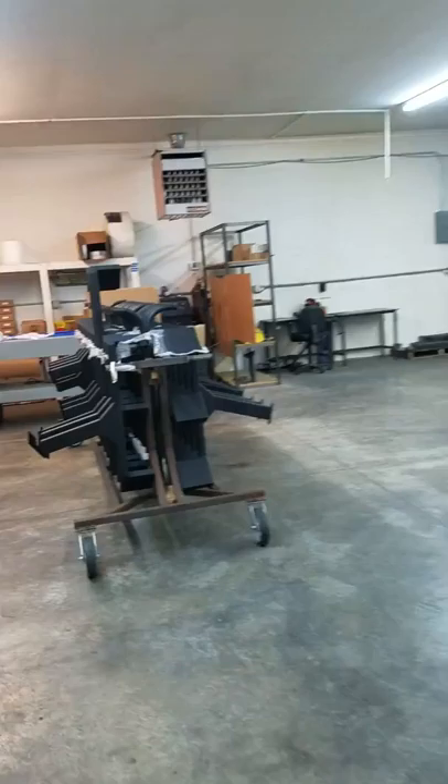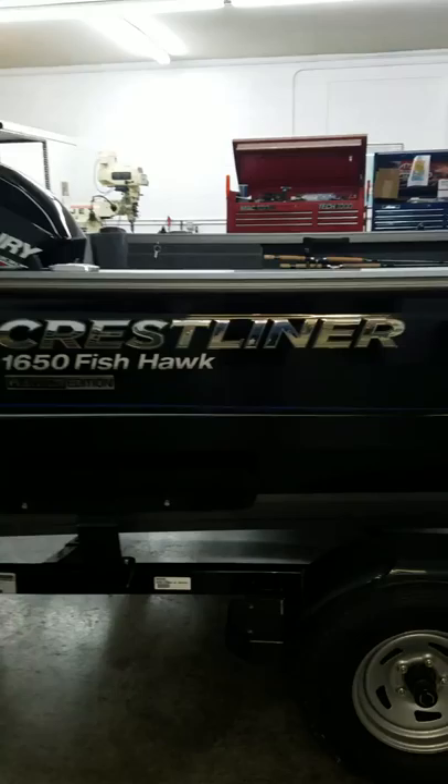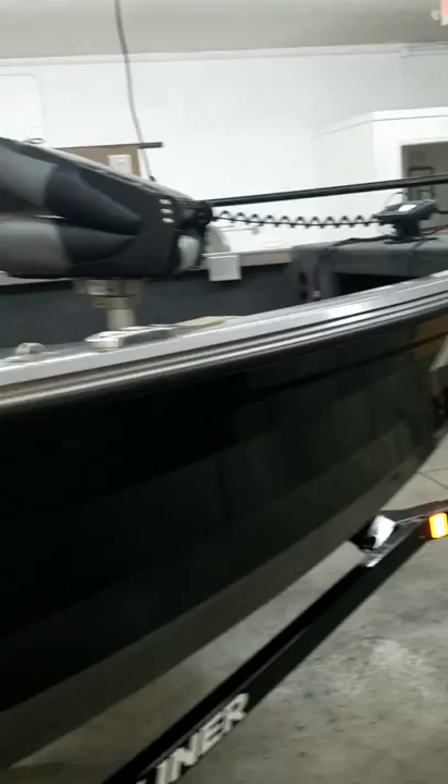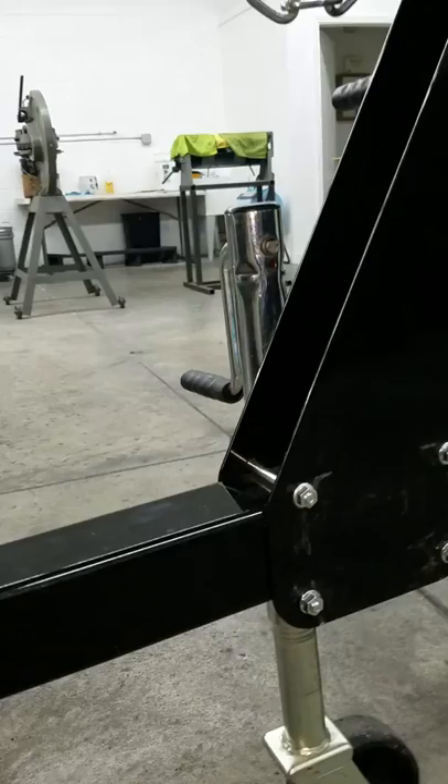But what we haven't had — and we're going to make a part number for — there's a whole rack of steps that just came back from coating: steps for the Deep V aluminum boats that are on Shorelander trailers. We've got a Crestliner 1650 Fishhawk right here. It's a really nice fishing boat, but they're hard to get in. It was hard for us, until we finally got one of these boats in the shop, to make a step that would clamp around the winch post — it's just not going to happen. But it does have a 3x3 square tube right there, and that's where we're going to go.